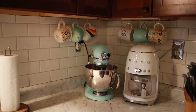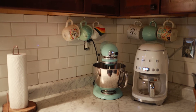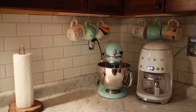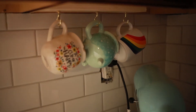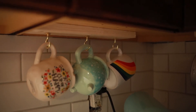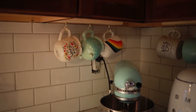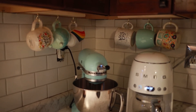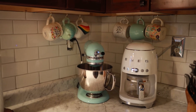This project is done! All I used was one scrap piece of 1x4, cut down to 13 inches — two 13-inch boards. I bought some cup hooks from my local hardware store, screwed those hooks into the board, and then screwed the board into the cabinets. These cabinets are pretty old but they have a lot of life left, and I don't think a couple of holes will hurt the resale value.